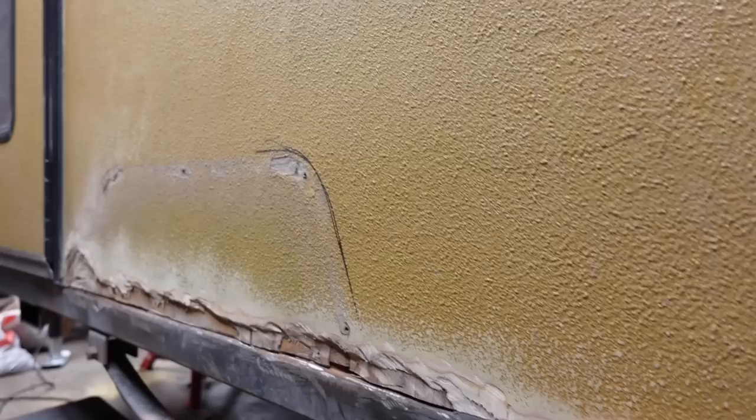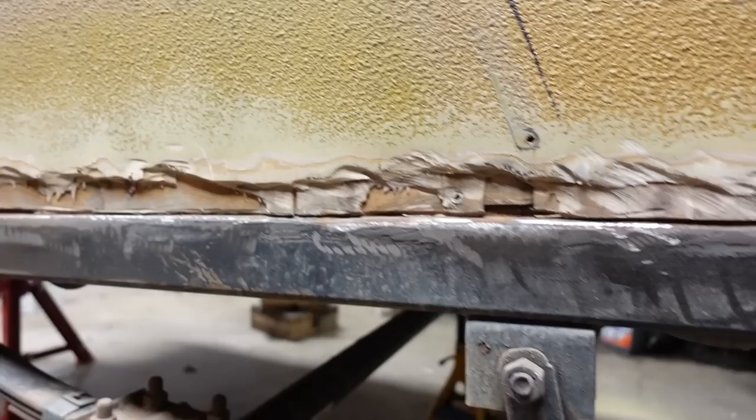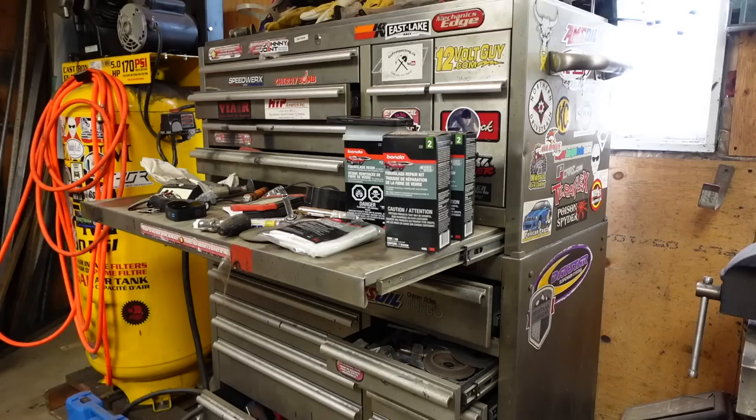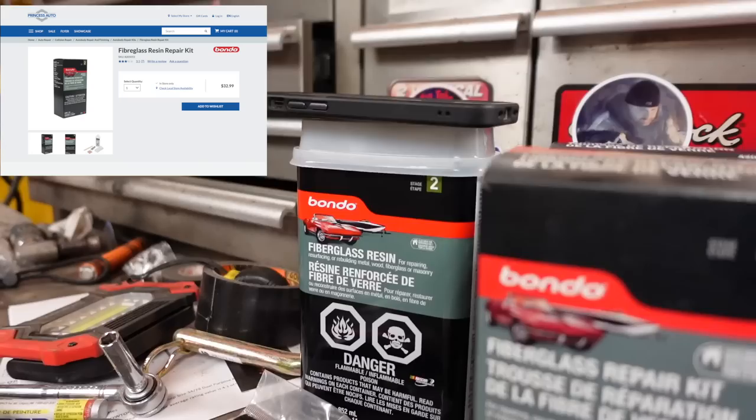Unfortunately, this is the side that's really bad — where the fender was, it really got underneath the wood and I had to chew it all out. There's going to be a big fiberglass repair on this side before we put the aluminum plating on. These repairs are going to take a little longer than I thought, but it's going to be worth it. This reinforces the idea of putting aluminum angle iron all around the corners to help eliminate the seams from getting moisture in. The good thing is the roof is rubberized — I've got some rubberized paint and I'm going to put another coat on, plus rubberize underneath it.